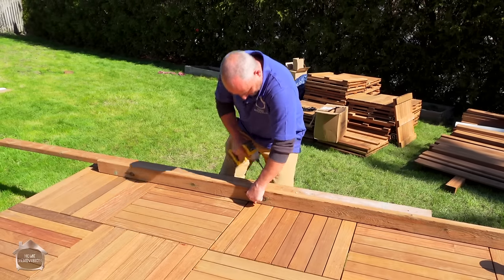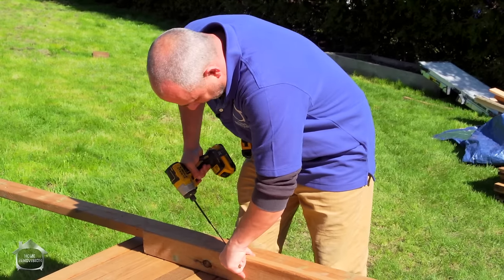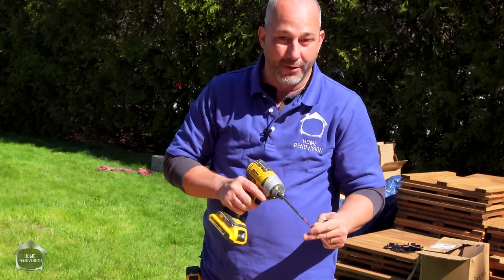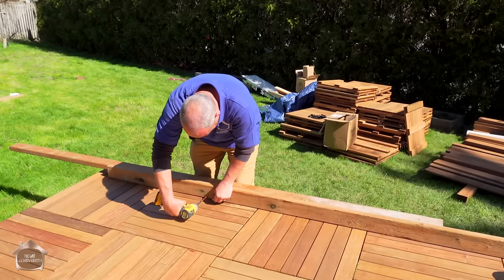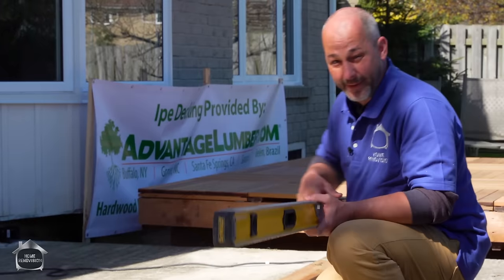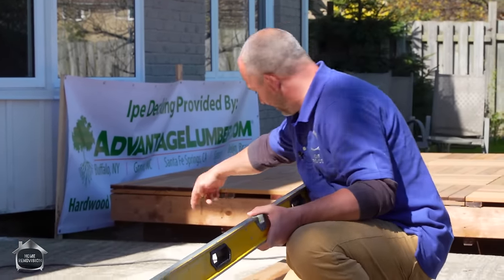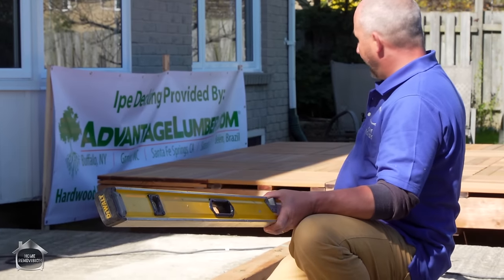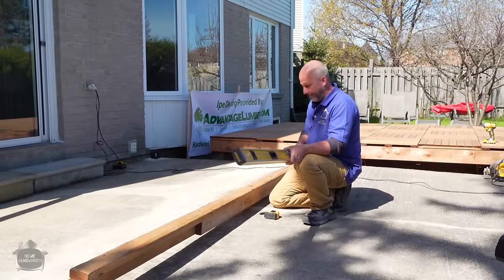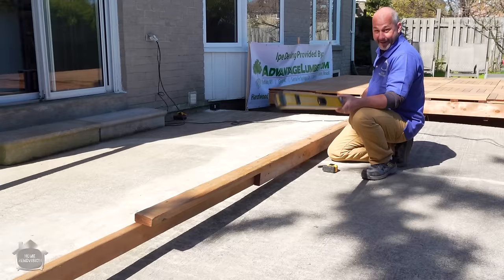Nice, yeah. Once we have this assembled, we can stretch it across the saddles, get our measurements, because there is just nothing better than having perfectly level product to work with. So we know from measuring earlier that the highest point on this slab is actually right over here, but the saddle on the other side over here is actually the highest saddle on the slab. It was installed about a half an inch above the concrete. So we're using that as our measuring stick to go for every corner to get all of our heights.